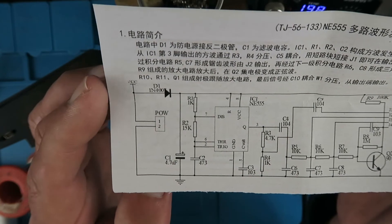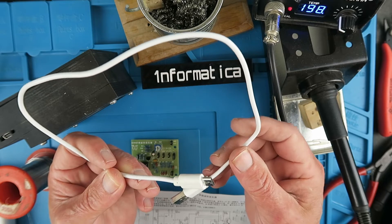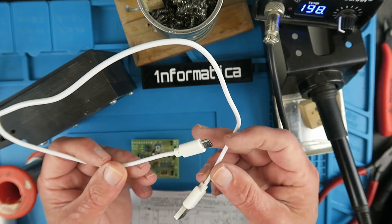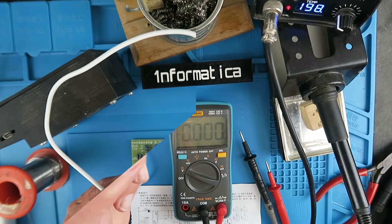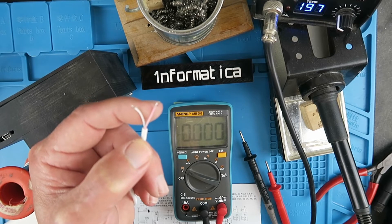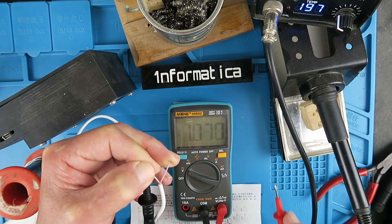What I've elected to do is sacrifice one of these USB leads — but it's caught me out before: it only has connections for power, not data, so you can't connect anything to your computer with this cable. I'm going to solder it onto the board to power our project. Having stripped the cable we can see there are only two conductors inside. I'd guess the pink one is positive — let's check with the meter: yes, 5.12 volts. I'll get that soldered onto the board.